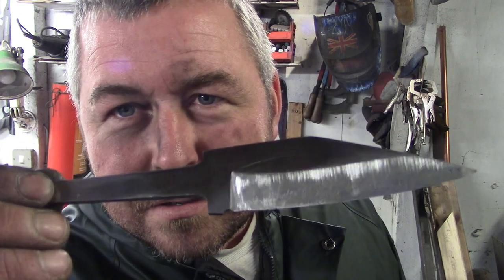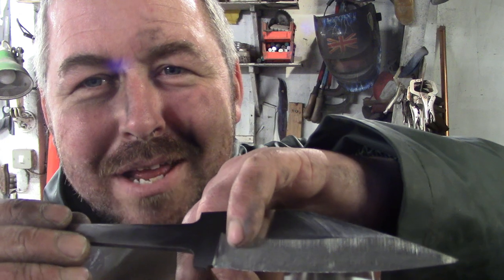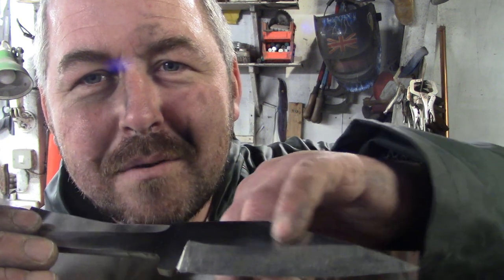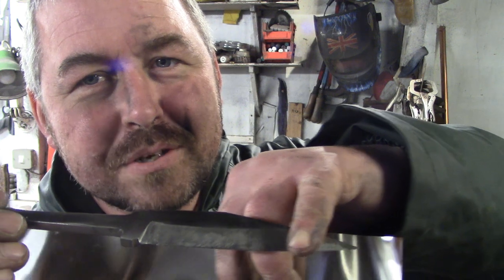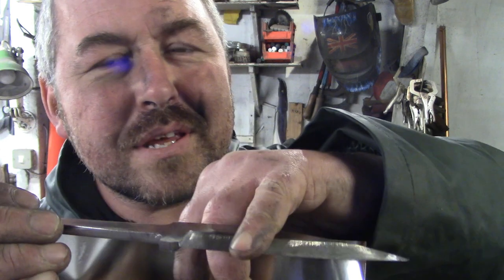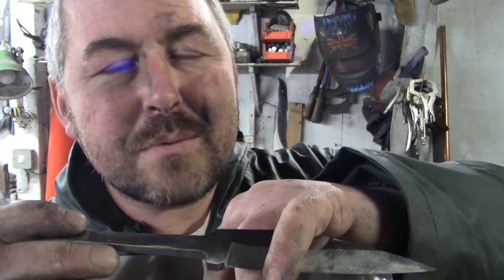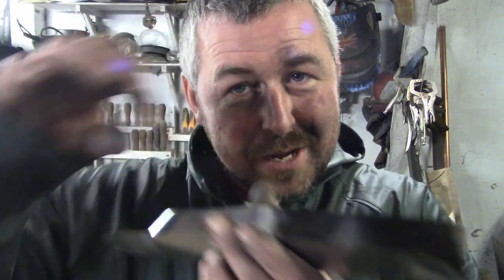So just a little bit of an experiment. That line is okay. I'm trying really hard to keep things neat and tidy. On the rest of it, I've been polishing this blade up, and I've gone over the bevel line slightly. We should be fine because I'll polish the grind up with a flat surface and emery paper once we've hardened it. There's no point doing this now because I don't want an edge on it quite yet, as we're just about to quench it. But the rest of it I've polished up, and we're going to put it in the stainless steel foil, make an envelope, and try to make it as airtight as possible. I'll crimp it down with the bead roller, and then we'll sprinkle a little bit of coal dust in there.